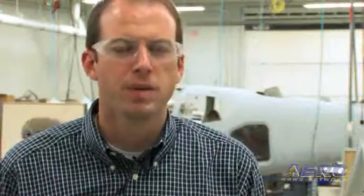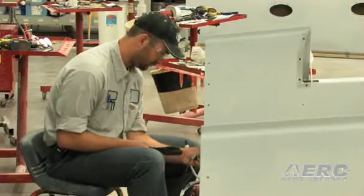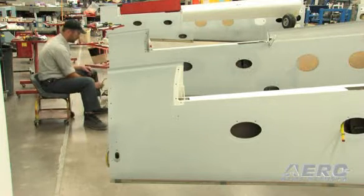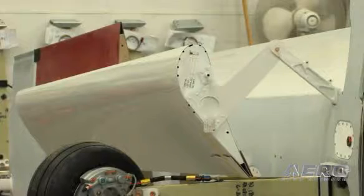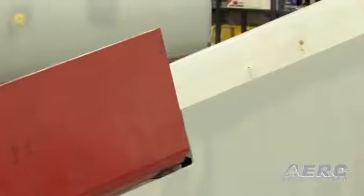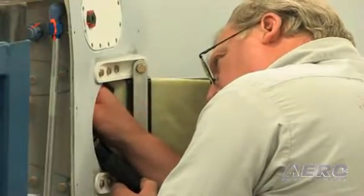In the area behind me you'll see the wing going through a much similar process as the fuselage did moments ago. The wing comes out of our bonding and prime shop areas with some of the trailing edge areas that are harder to get to pre-painted. We bring them over here and start doing the installation of main landing gear, flight controls, flight control cables, fuel plumbing. Again, trying to get as much as we can inside the components of the airplane in the most readily accessible state that it is in.